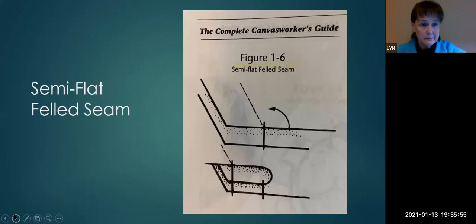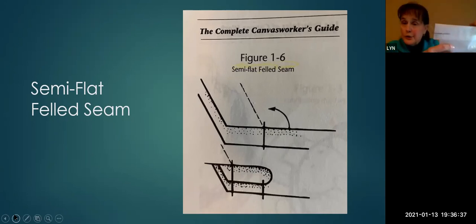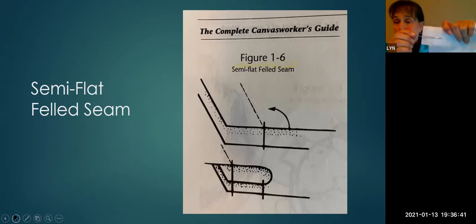Let's talk about sail repair. It's a good idea to have adhesive-back Dacron on board for emergency sail repair. You can tape a tear immediately and come back later to zigzag around the edge for a more permanent patch. At the end of each season, examine your sails for tears, holes, or broken stitches and do repairs in the off-season. To test thread condition, do the needle test: put the needle underneath the thread and pull up — if it breaks, you have UV damage and need to replace the thread.